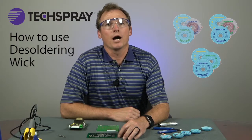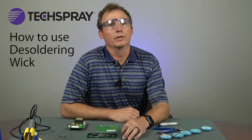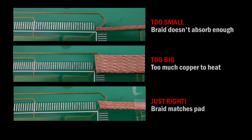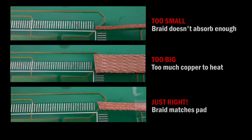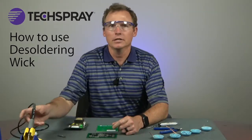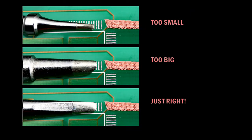Tech Spray is one of the most commonly used brands of desoldering wick in the world. Let's look at the steps of using desoldering wick. Step one is to choose the appropriate size of soldering wick and soldering tip for the solder to be removed. Choose a width of wick that is similar in size to the glob of solder to be removed. Using wick with a significantly different width will make solder removal more difficult. It is usually beneficial to keep several different widths at your workstation so you're ready to desolder anything you may encounter. Additionally, choose a solder tip that is reasonably close in size to the width of the wick.